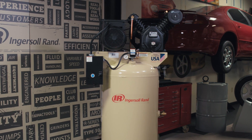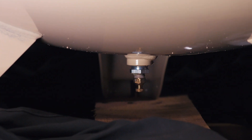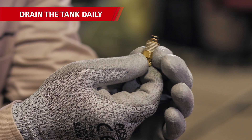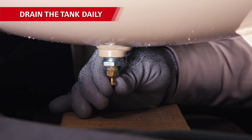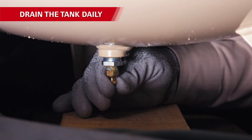So how do we get rid of it? Just about all of the water will settle in the bottom of the compressor's air tank, so you need to drain it on a daily basis. The standard drain is a petcock style unit located at the bottom of the tank. Open the manual drain valve and let the air and water exit the tank until there's nothing else coming out. Close the drain and you're done.